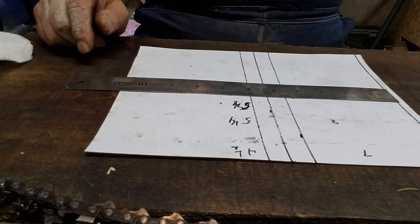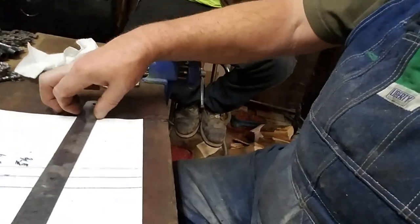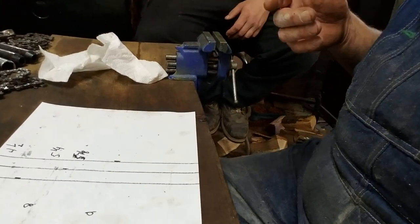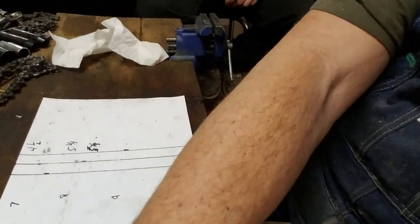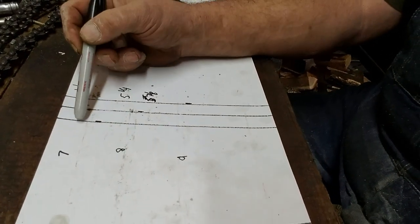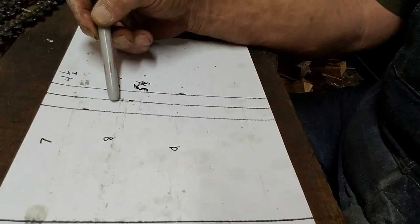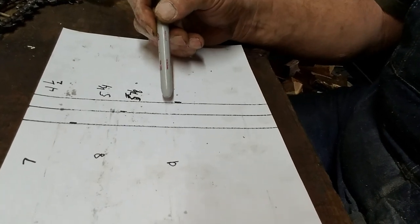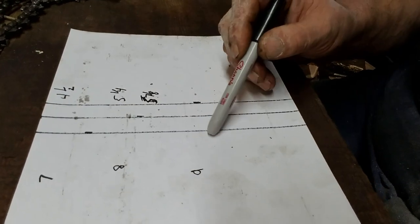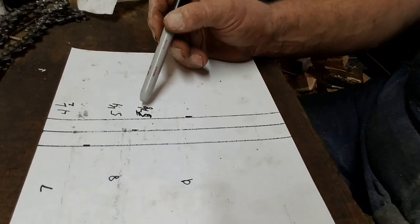There's a little bit of a funny thing there. So when you realize, let's say your chain speed is, let's go saw RPM, for every revolution of that engine, it's going 4.5 inches with a 7-tooth. It's going another 3/4 with an 8-tooth. So it's 5 1/4. 9-tooth, 5 7/8. I mean, exact figures, we know that. But you can see the spacing is fairly even. I'm off a little bit there and I don't care. This is just an example.